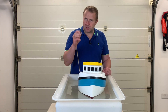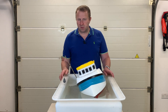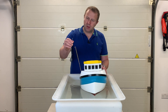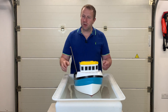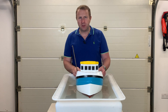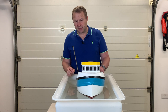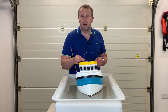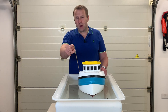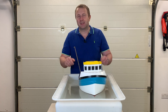If I use that same weight and hook it on the derrick, completely different list. The reason for that is when you hang a weight from the derrick or a crane, the weight acts as if it's actually at the point of suspension. That point of suspension is a lot further away from the vessel's centre of gravity than when I had the weight on the side deck. The moment produced by a weight on the derrick or crane is much bigger and therefore the list is much bigger.